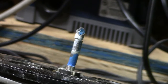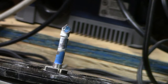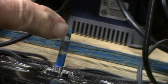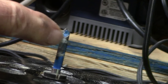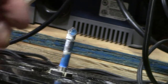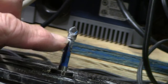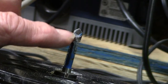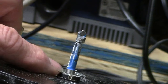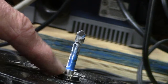In order to cut the holes when you've covered it with laminate, you want to get one of these — a plunge bit. It's got a collar where it rubs the material, it doesn't cut the material, it just rubs against it, just like a mortising bit, but it's also got a cutter right here on the same height as your rub collar. You can also use it the other way — there's another rub collar on the bottom, so you can use these bits either way.